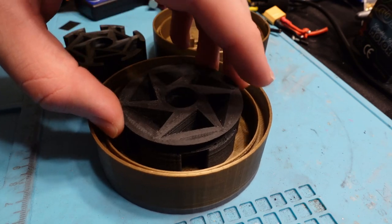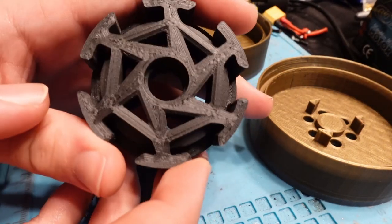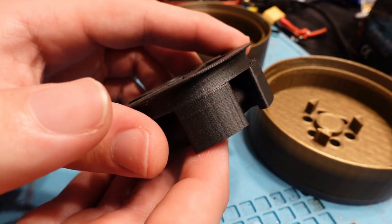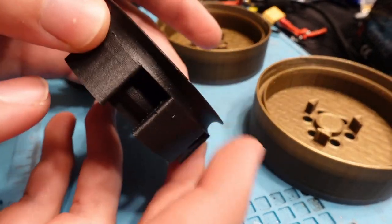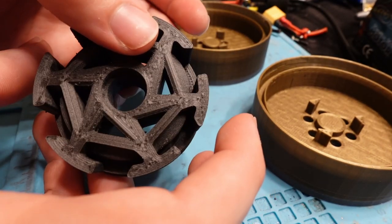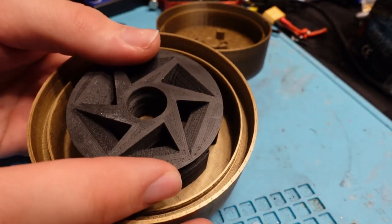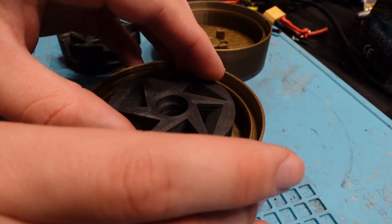I'm about to start doing some molding for new wheels for Drakonid. I have here some 3D printed carbon fiber nylon hubs — this is pretty overkill, these are way heavier than they need to be, but they should certainly survive if the tire holds on. These were printed pretty much solid, and I have the belt groove here. The tire will expand to be about three inches in diameter. The hub sits in the mold — it's a little loose intentionally, but maybe I should have made it a bit tighter to keep it more centered.